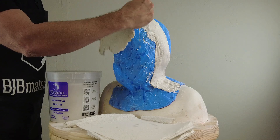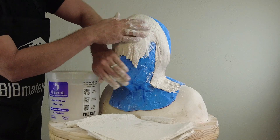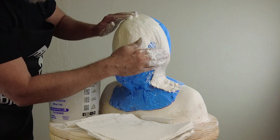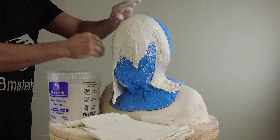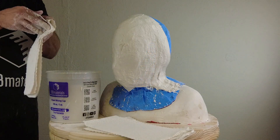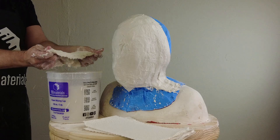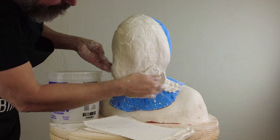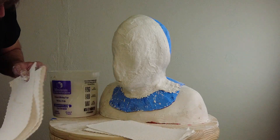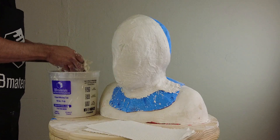Now we're just playing fill-in-the-blanks with the bandage material using those shorter pieces I cut up earlier, all three layers thick. Each time I put one down about halfway over the previous bandage, I'm creating six layers of reinforcement. I typically like to work from the top down so I get a minimal amount of water runoff on my bandages. If you work all over the place and oversaturate your bandages, it takes a lot longer for them to cure completely and reach full strength.